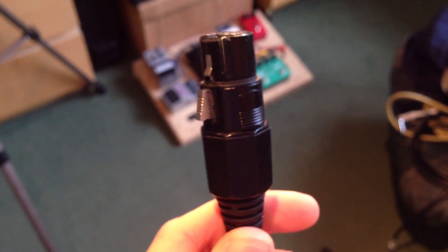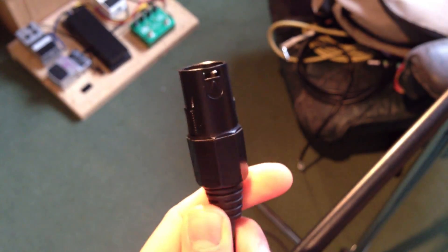First off I'm going to explain how I set up mine and how I would recommend setting it up. The first thing I did was throw away the cable that came with the microphone, which was an XLR to 3.5mm — it was a pretty useless cable in this situation. You guys might want to hang onto it because I'll explain how you can use that cable later on in the video. So I got one of these — this is an XLR to XLR cable, designed for microphones and designed to carry phantom power, which I'll explain why that's important later on.